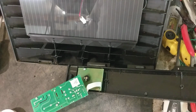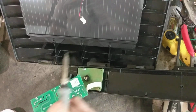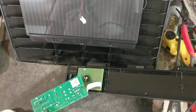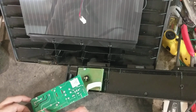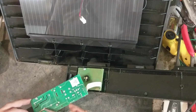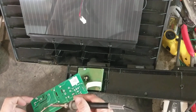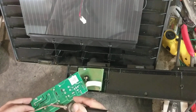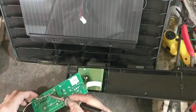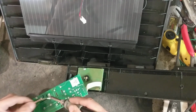So we are going to desolder it off here with some desoldering braid. It's got 4 solder joints on there, and they're offset over here versus over here. They're not a perfect square, so you really can't get this transformer plugged in the wrong way. It only fits one way. And this is kind of basic soldering. It's nothing too terrible, but you'll definitely want to do it right. So you suck the solder off each spot.